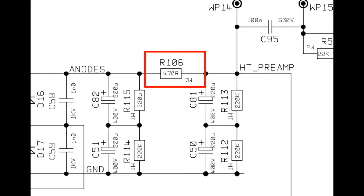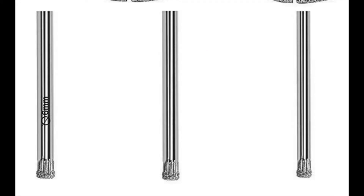On a side note, this amp can be pretty noisy in the OD section. To deal with that, most manufacturers use a filter choke, but unfortunately Marshall left one out in this amp. The filter choke replaces resistor R106. Installing a choke is fairly easy — you just pull that one resistor and mount the choke on the chassis. There are some great videos about it; I've labeled one below.